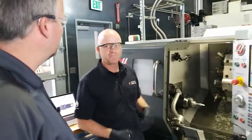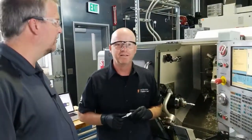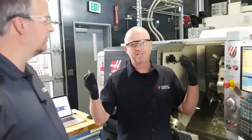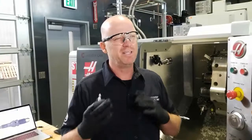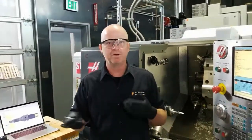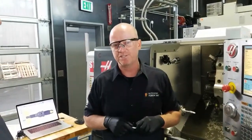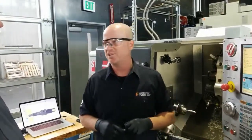Yeah, so again, it depends on the environment and the workshop. In my past I was at Tesla, and over there what the guys in the shop did is we had a number of machines, and for example the first 20 or 30 tools all matched on all the same machines. So when you program a job, you need to know kind of what machine you're putting it on, but then you would program, and then we'd get out to the shop and see what machine's available. So then you post, and your first group of tools are all the same and they all match. We'd have a standard tool library that handled 80 to 90% of the jobs.